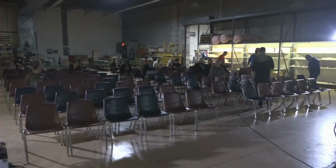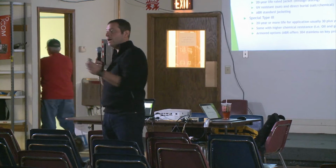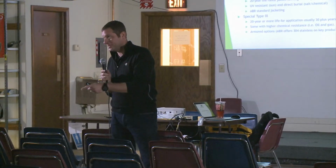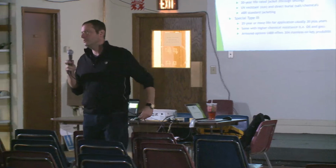Back to the ferrites. Sure. Placement of the ferrites. Closest to the transceiver? It's typically, so if you look outside, they're just outside in HRO, it's typically, I don't know the specific math, that's going to be Chuck on the physics side, but you're going to have probably about 6 inches off of the connector is what you typically would do.